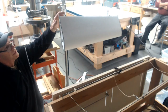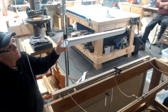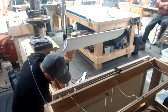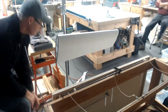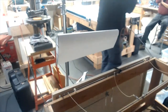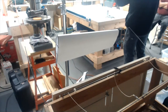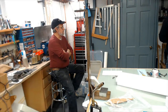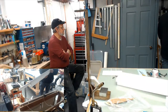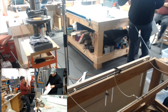What do you mean, the cutting both sides? Yeah. You probably wouldn't want it because the wing will rock. When you pull it vertical, the wing doesn't rock. And what I mean by that, as you know, the wire isn't perfectly straight going through that core. It might have a little lag in it. If you're going horizontal, there's no way of keeping the wing from doing this. When you pull it vertical, gravity keeps it from doing this. Okay. So I've already thought about that. Yeah. So I couldn't figure out a way to go horizontal. I already thought about it, and I couldn't figure it out just because of that reason.